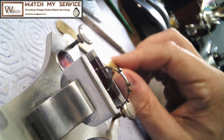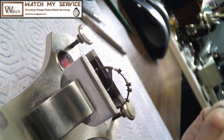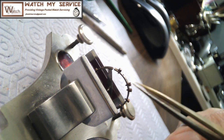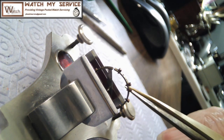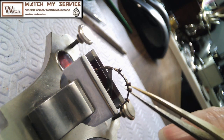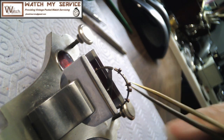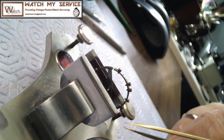So that's it on poising a balance for now. This is called static poising, which means the hairspring is off the balance right now. When you put that balance back on with the hairspring there is dynamic poising, but I'm actually not sure how to do dynamic poising - I'd have to do a lot of reading and research. Dynamic poising would be poising the balance while it's on the balance cock and installed. The other thing is you could take a hairspring vibrator, grab the hairspring in your hairspring vibrator, and dangle that down to a master balance, then vibrate the balance in the hairspring to see how close it is to the correct beats per hour.